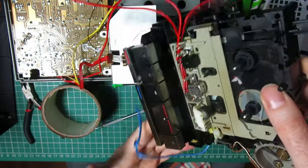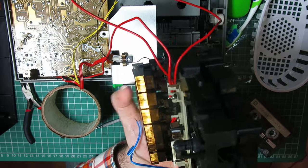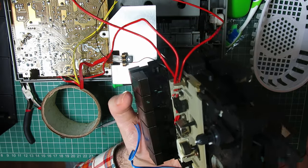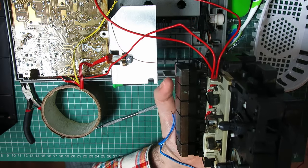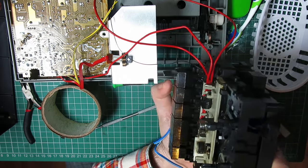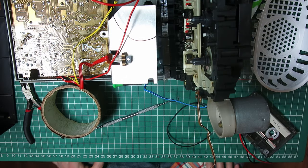So that's all been put back together — that's as good as it's going to be, I think. Sometimes it does still get stuck just a tiny bit, but it's kind of a case of if you just bop it on the top it should come free. It's not ideal, but there's not really much more I can do — it's just because this is all plastic. Any kind of lubricant to put on there it seems not to like, so I've just put a little bit of machine oil in there. I'm going to leave it upright overnight — it is better upright the way it should be. From a mechanism point of view, good to go. I'm really happy with those gears though — they've been fantastic.